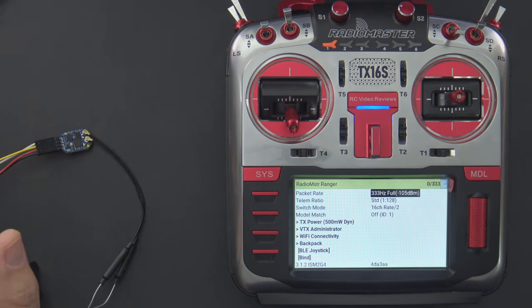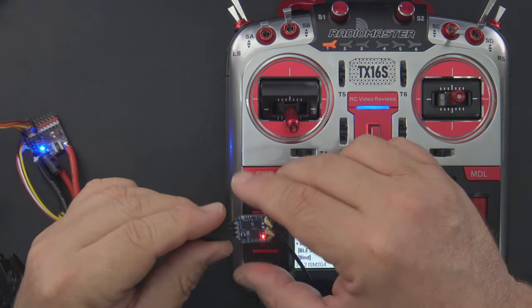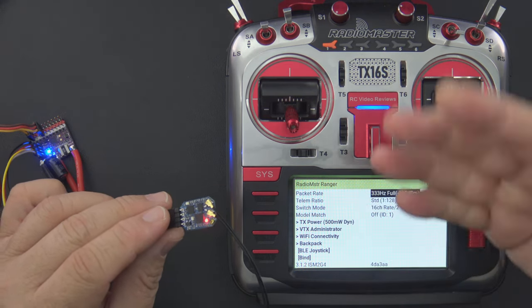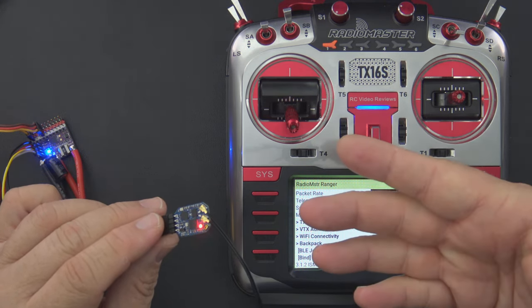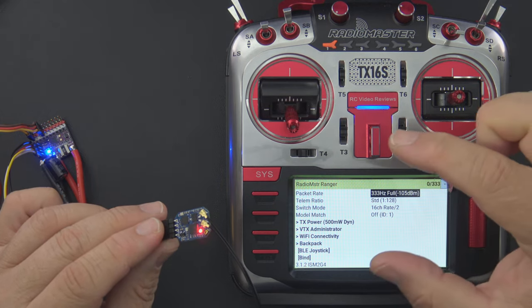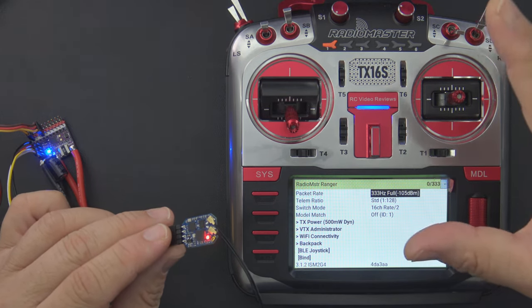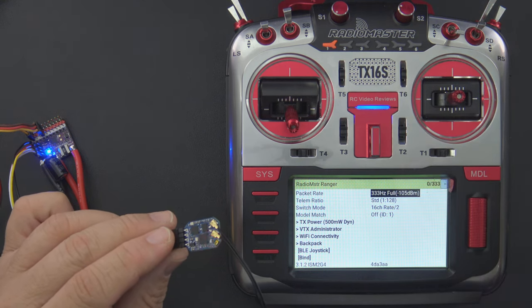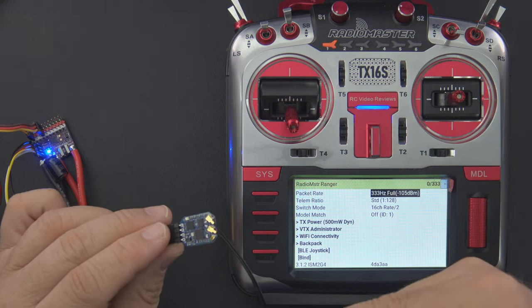Okay, if you have Betaflight, so if you're using quads and you have a receiver connected via Betaflight, you can flash directly through Betaflight. So all you need to do in that case is bring up Betaflight and don't connect. You could connect and verify that your COM port is working, but once you've done that, hit disconnect on Betaflight, and then you can run the configurator and flash directly through Betaflight.